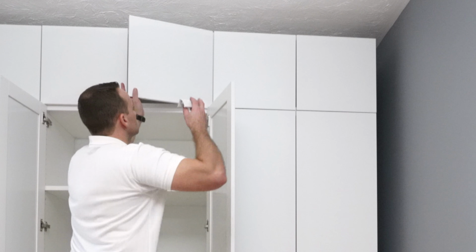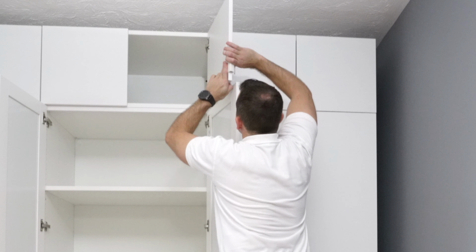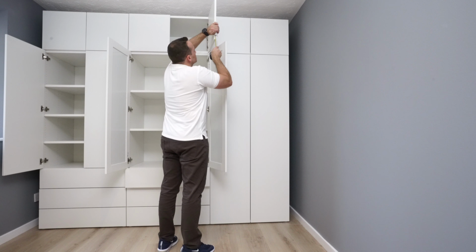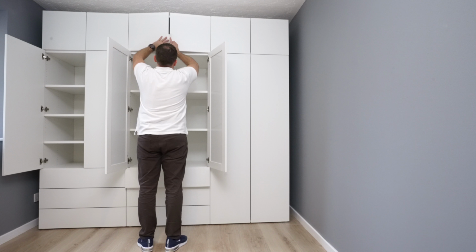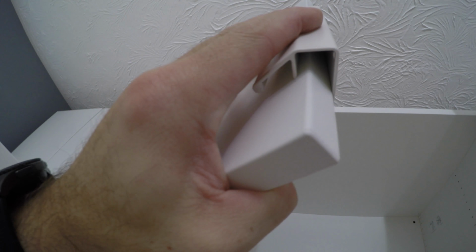Here is door handles. This is a very specific door handle, and you just have to clip it in on the edge. So just measure how far you want to go from the edge of the door. Here I choose one measurement on the top, and then I'm just gonna clip the other side, not gonna even measure it. You see, when you close it, you can put the second hinge there, hold it in place at the same height and just clip it in.